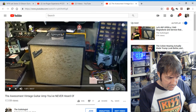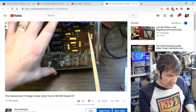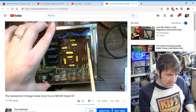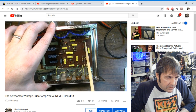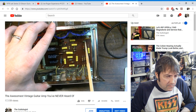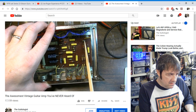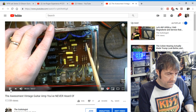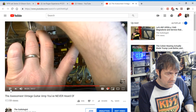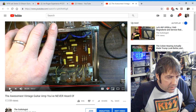Let's see, it's right around in here somewhere — I'll start pointing at it. Drop down a little bit. The ground reference or grid leak resistor is this one, and it's a 470 ohm as opposed to a 1 meg, which is what we tend to see and what we see also in the schematic for this amplifier. I am going to go ahead and change this to a 1 meg. They probably changed that trying to clean it up a bit, because at the time this amp came out, distortion wasn't — anyway, you get what I'm looking at right there.